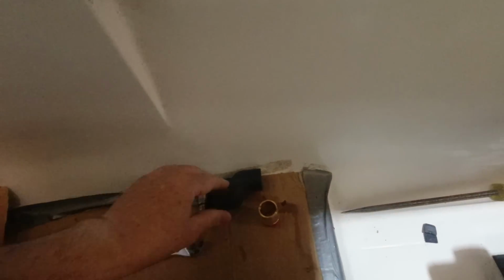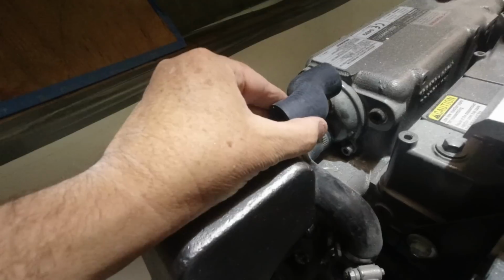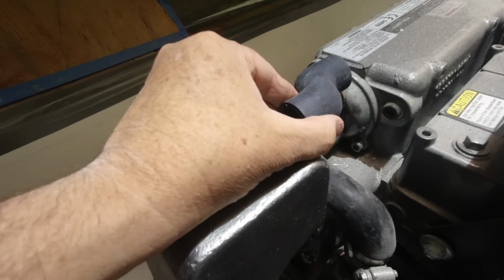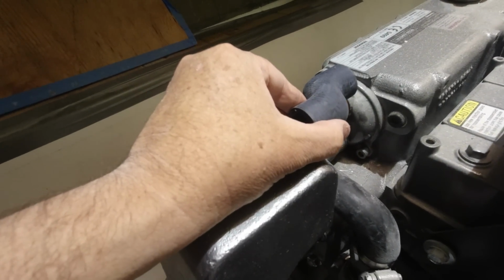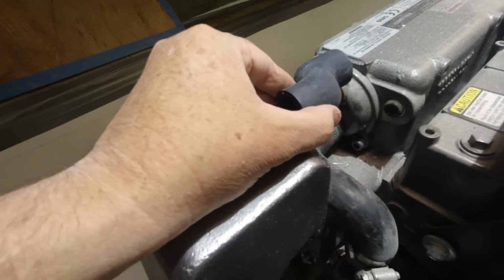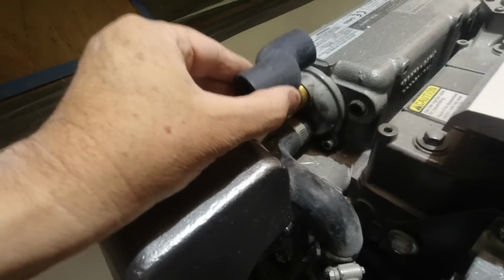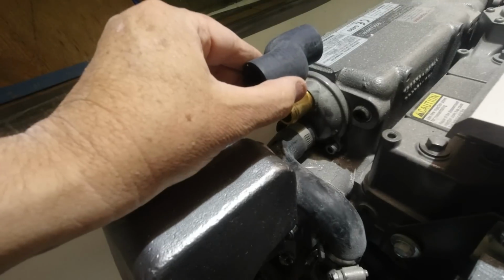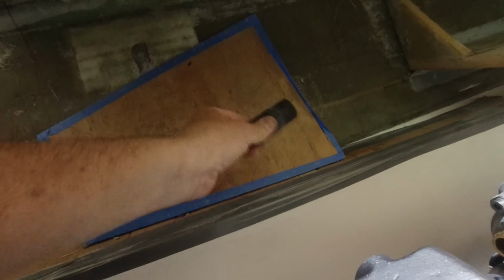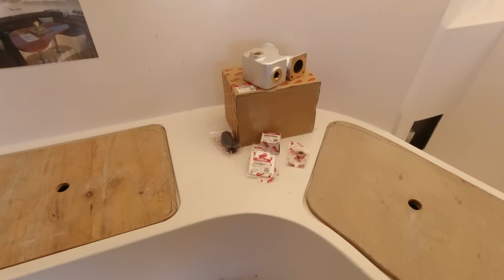Now I have these other parts here. I could either do that, and although I am just above the waterline, I think it's 15 centimeters that I'm looking for, and I'd be right on that. I'd probably say, depending on the displacement of the vessel here, probably 10 centimeters above. But technically, to get it 15 centimeters up to here, I really would like to put in some sort of vented loop, and obviously bring it back into here, and that's going to solve all my problems with no chance of any siphoning back. Alright, so I'll go and fit this one.